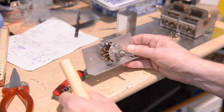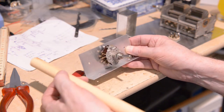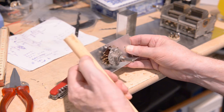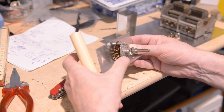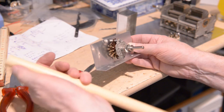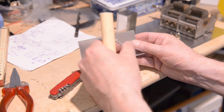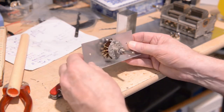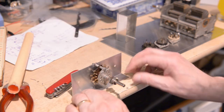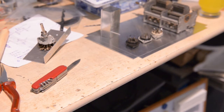And if that hole is too big, apart from the fact that you will distort this bracket, you can't really mount it anymore, so you have a lot of trouble there. So to prevent that, I will just cut little pieces off, make the coil on there, and then fix it in with a bolt on both sides, and then that's it. And of course the metal will have influence on the inductance of the coil, but it doesn't really matter. That won't be that much anyway. So, anyway, you have the idea what I'm going to do. It will be mounted like that, and the coils will be on here on both sides, and that's that. And the other point I want to make is, sorry about that, I had to readjust the camera a little bit.